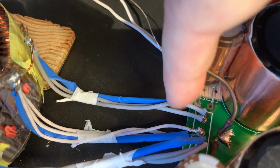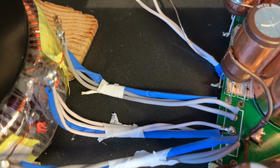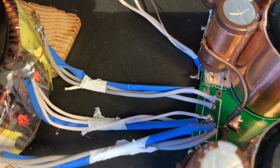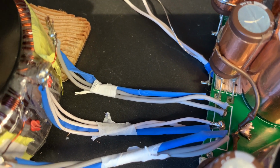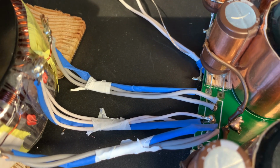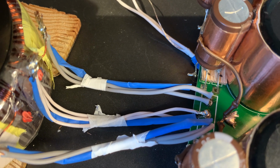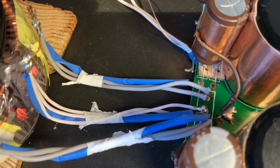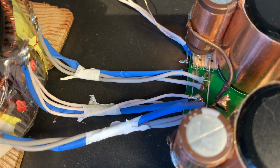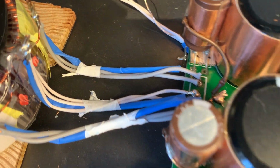You see those gray guys, those are Kimber cable, basically a Kimber speaker cable taken apart, and the blue thing that hides silver. That's like a gauge 20 antique sterling silver. So I like doing that, paralleling silver with the copper. And of course, if you have everything pure silver, it's even better, but I do not have an endless amount of silver. I'm not rolling in silver. So that's why I'm doing this method, and you can try it as well. And depending on your component, you will either like the sound or not.